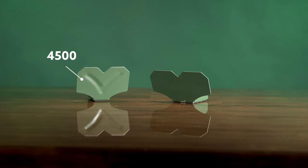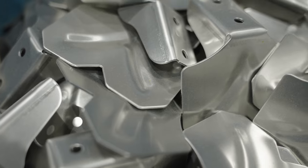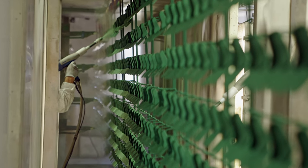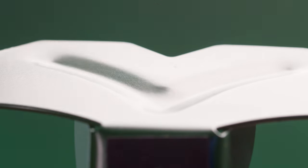Here I have the Snow Defender 4500 for flat purlins and the 1500 for vertical purlins. Both are made from 16 gauge stainless steel and both are powder coated in popular colors. They come individually packaged in bags to protect that coating. The 4500 has an embossed V design for added strength.